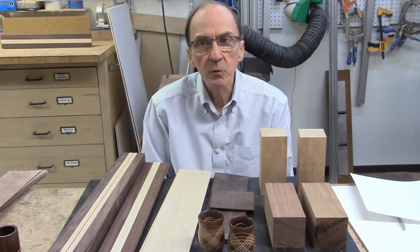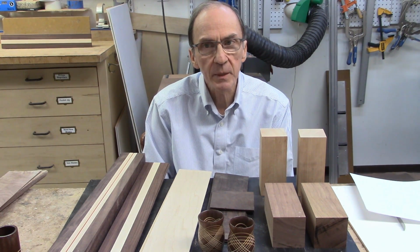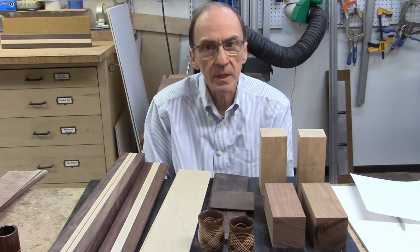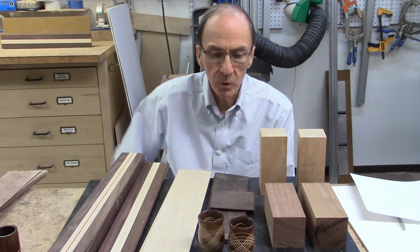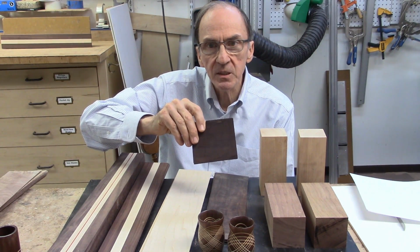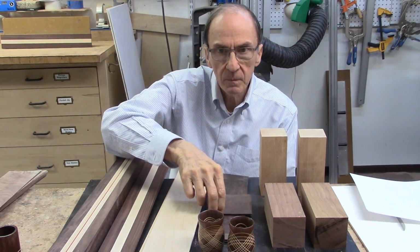Once again, the Celtic ring jig will be used in conjunction with the Accu-Slice rail system on my Laguna bandsaw to cut the slots for these wood inserts. On the bandsaw, I'll be using a Timberwolf bandsaw blade, 10 teeth per inch by 1/2 inch wide, rake tooth design to make the cuts for the wood inserts. The kerf of this blade is 50 thousandths of an inch thick. Therefore, the wood inserts must be between 46 and 50 thousandths of an inch thick in order to accurately fit into the slots in the boards.